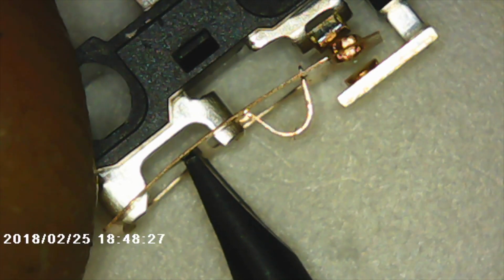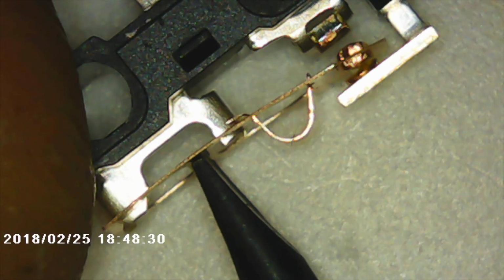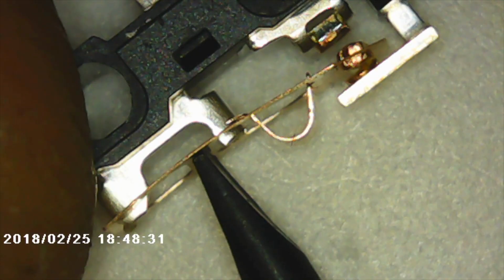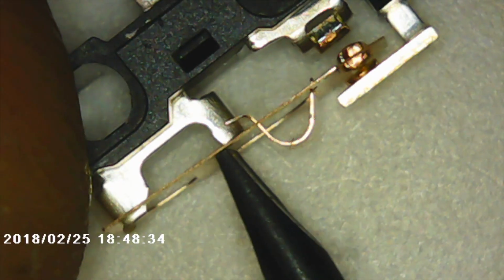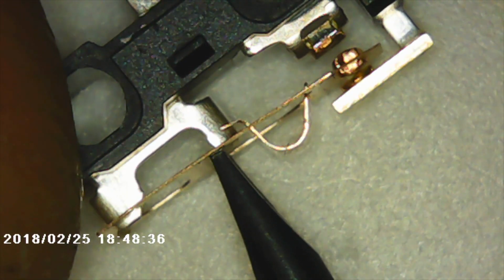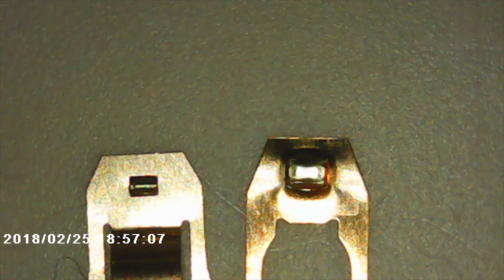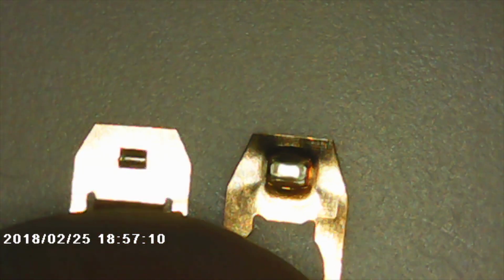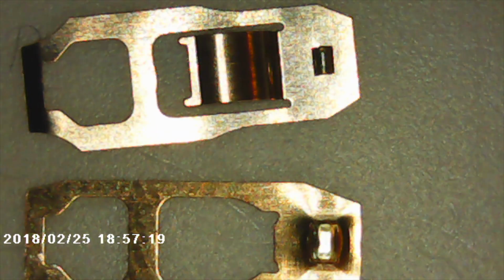So as you apply increasing force to the top plate, that eventually reaches a point in the equilibrium between that and a compression spring with respect to the fulcrum in the middle, and there's a snapping action as it flicks very quickly to a different shape, and then the contact smacks against either the on or the off position. So the shape, the thickness, the mass, the material properties, and the size of the gap are going to affect how this switch feels, how much force you have to apply, how hard the click is, things like that. In conjunction with the spring on the bottom, that's going to affect both that and the return force. And then you have the contact on the end, which is the part that's doing the actual switching.